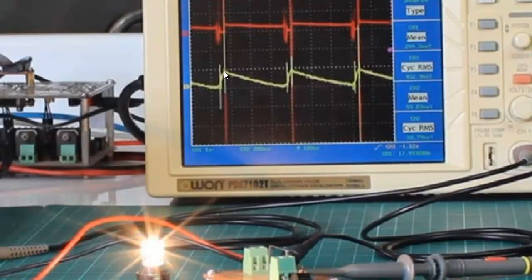So over here, on this slope, your input's completely off. All of this area under the line is work being done in the system when your input is off. And you'll find, if you study close enough, that the input coil actually sends current back to the source in this area. Your input coil is on in this small region in here. On this big region over here, your input coil is off, but it actually sends current back to the source. So it's a negative power, not negative energy, negative power.